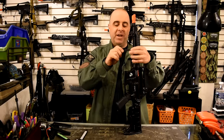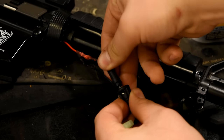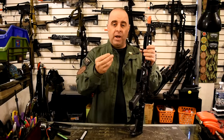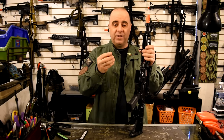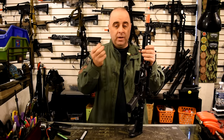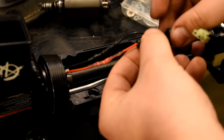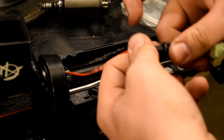The next potential problem is the fuse. When you take the fuse out of the gun it may look visually fine, but quite often these get rattled around to the point where there are breaks on the inside that prevent electricity from passing through. The best bet with a fuse is to just go ahead and replace it with a fresh one and see if that makes any difference.